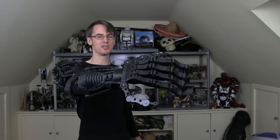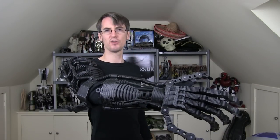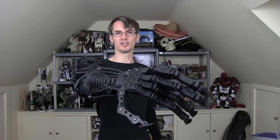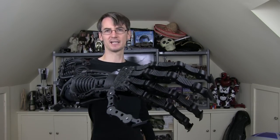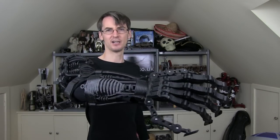Hello, it's James from xrobots.co.uk. This is part 7 of my scrap metal sculpture inspired 3D printed Alien Xenomorph suit. In previous episodes I made the arm for Alien, which is made of hybrid prints of rubber and rigid material, printed on a Lulzbot TAZ 3 with dual extruders — one flexistruder and one standard extruder — so I can fuse rubber and rigid material together in one print. Some parts are rubber and flexible, some are rigid and jointed, and some parts are both rubber and rigid.